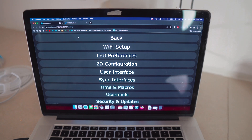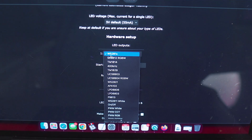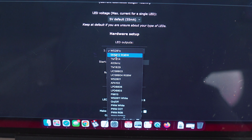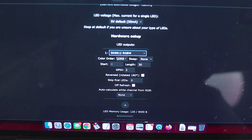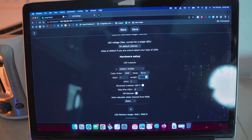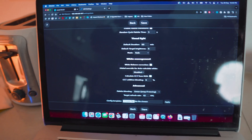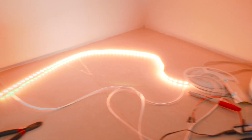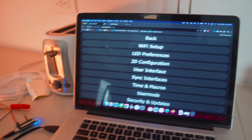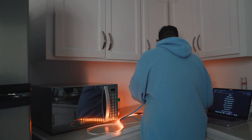Except the whole thing's not lighting yet — we're fixing that now. Hit the config button, hit LED Preferences, scroll down to where you see LED output and choose the LEDs that you have. This is where I'll put SK6812 — if you chose the other one, this is where you'd put it as well. Right below that you'll see a box labeled Length. Take out the default value and put the amount of LEDs on your strip. Yes, you need to count the exact dots on your strip and put it in there. Hit save. Leave a comment if it doesn't work — I'll try my best. At this point, if you didn't cut the LEDs, you're done, you can just use it as is.